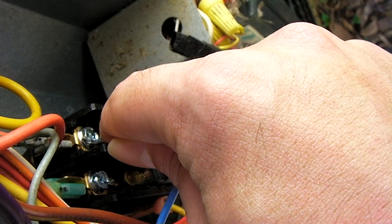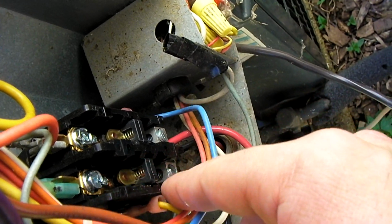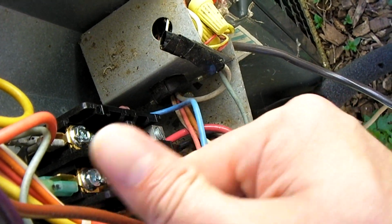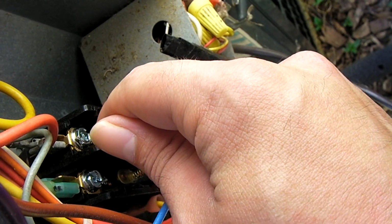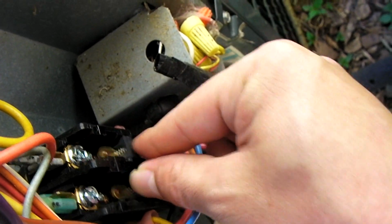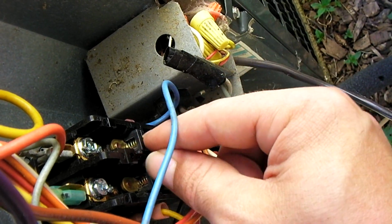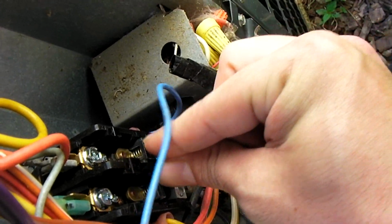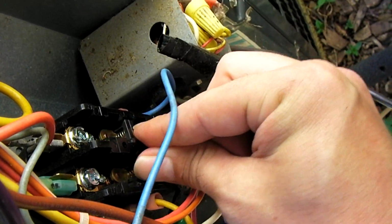As mentioned, bug sitting right on top of the contactor. So while L1 was able to pull in, L2 was not. There was a bug between this contactor and L2, which did not allow the compressor nor fan to run. So, as you see, the contactor mates just fine now.